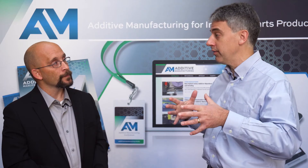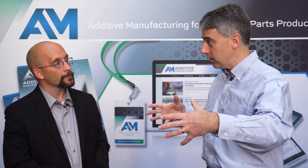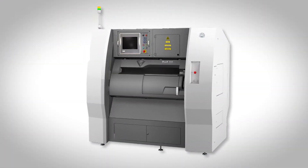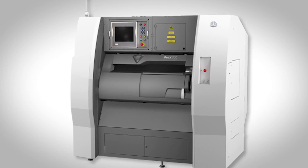Productivity increase — you mean productivity at the molding machine making the plastic part, reduced cycle time there. Yes. The additive machine we use was supplied by Methods 3D, who helped us deploy a 3D Systems ProX 300 into our facility. We are currently using maraging steel.